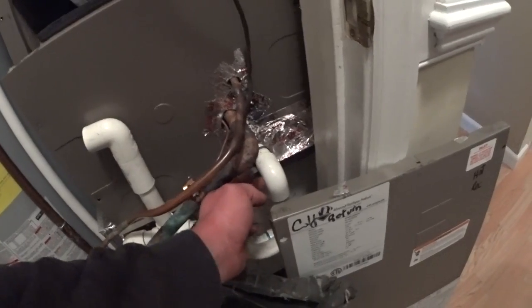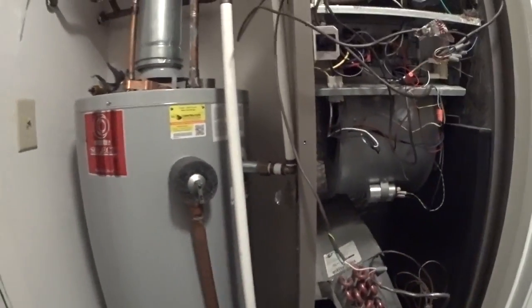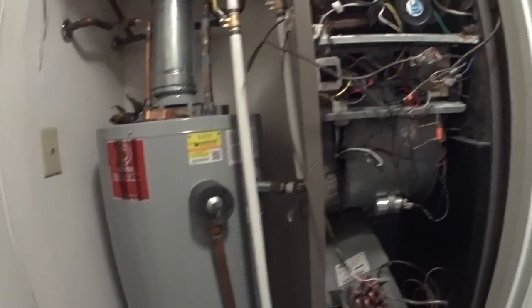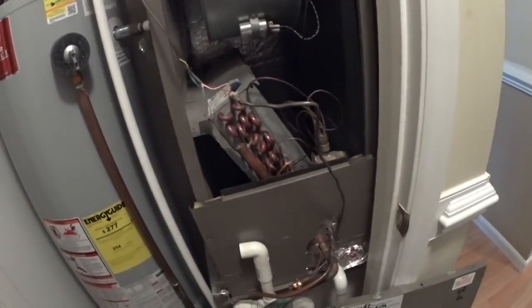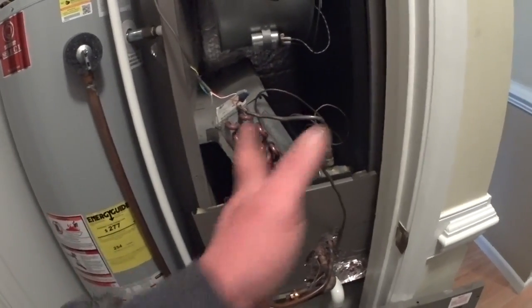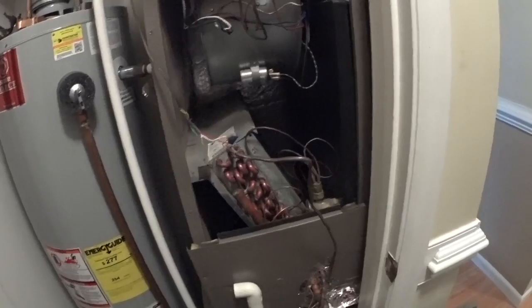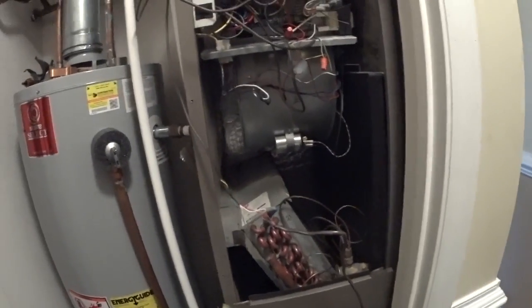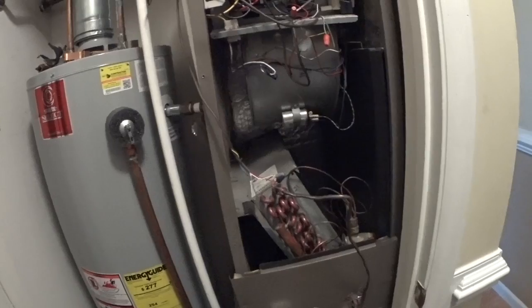Getting the door back on - I was hoping I might be able to relocate this drain over to the left side because the air handler is leaning, but with the piping in the way it's not possible to get the air handler to stand up unless we cut the water heater out and spin it. We'll get it insulated. It is a slant coil, so it isn't a huge issue if the air handler isn't perfectly straight because the coil only has a very small drain pan and we are on the primary drain side. Once I get this buttoned back up we will run the fan and hopefully confirm proper airflow.